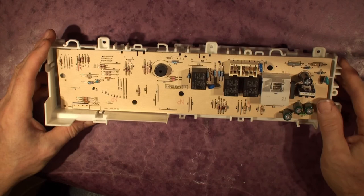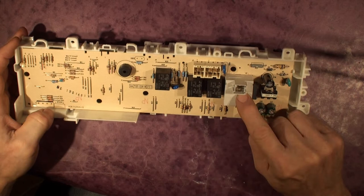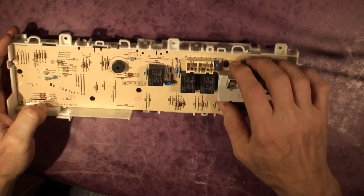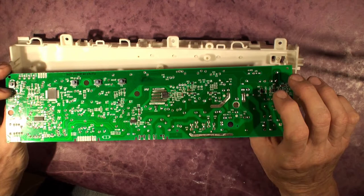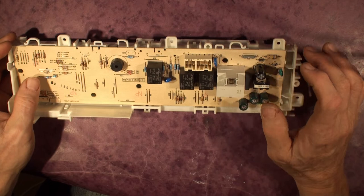So this is probably from a range of tumble dryers. The mains comes in here and goes through this rotary switch to set your program and the timer. On the back of this thing is a load of electronics, and the low voltage for the electronics — clearly you've got mains coming in but you need some DC voltage, around about 5 or 12 volts usually to control the logic and to feed the brain with power.